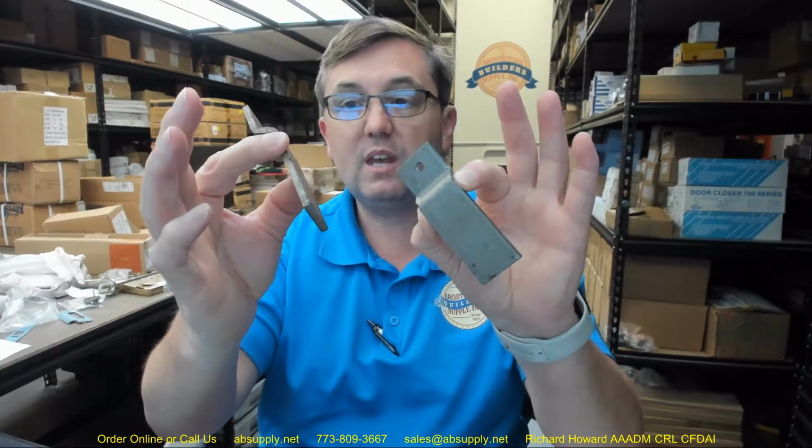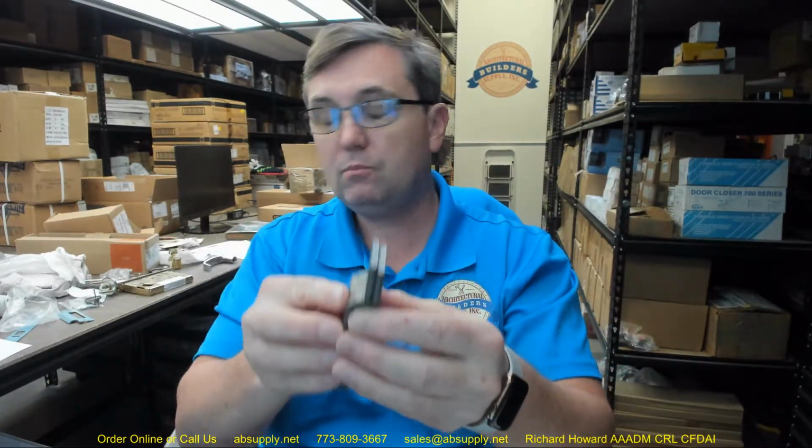I would also use a hinge as a fixture or a holding device. I would attach the hinge to my plates, and then I would use that hinge as a way to hold my plate secure as I tack them. I would then remove the hinge after I masked it off. I would cover it. I would make sure I didn't damage the end user's property. And then I would lay down the appropriate weld to keep these brackets in place.